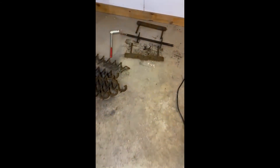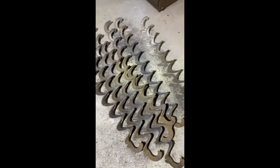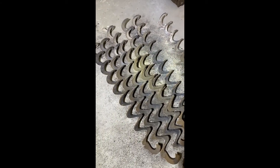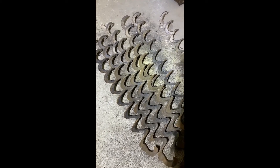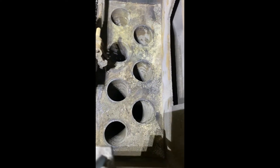Here's the mechanism that will not go back in — there's just no need for it. The turbulators simply pull straight up and out a lot more easily now. I shake them on the ground a few times to knock the fly ash off, then put them back after brushing the tubes. This also makes it a lot easier to vacuum out this entire chamber without all that mechanism in the way.